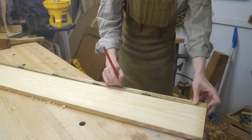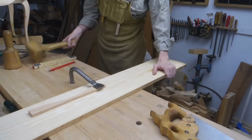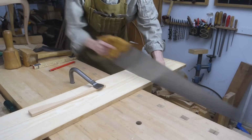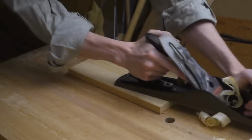One of the resulting boards then gets cut up into 4 short pieces to be glued into 2 panels. This is a good place to mention that the tables are going to be painted. If they would get a clear finish, I absolutely would have bookmatched these panels, but since the grain won't be seen, this way was more efficient on materials.